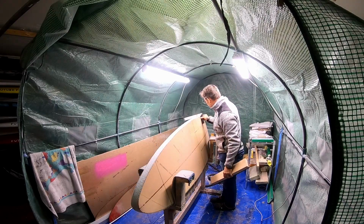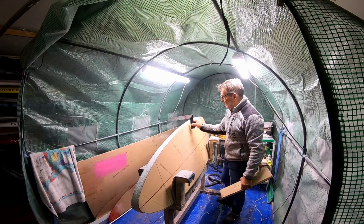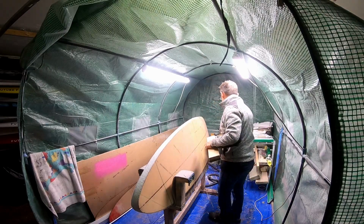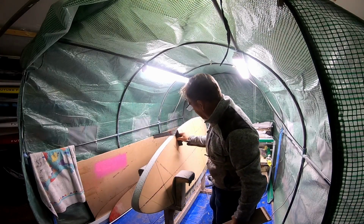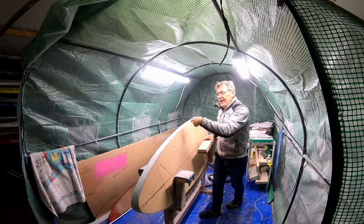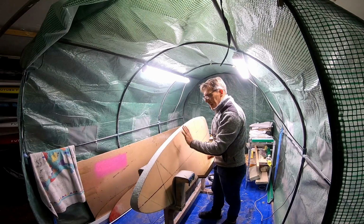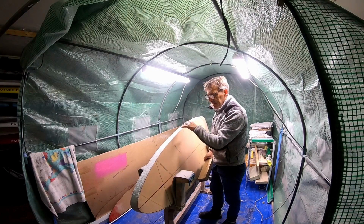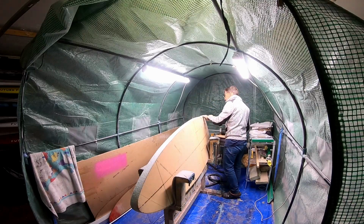And then always verify. As you can see here, this is completely off balance, not close to 90 degrees. So this needs to be secured as well. Here we still have a lot to work with. And of course this will affect the raw cut that I made on this side. That's also the reason why I want to make this side first, and then I can adjust all the lines on the top part later on. But I want to get this one correct first, so I get the correct outline.